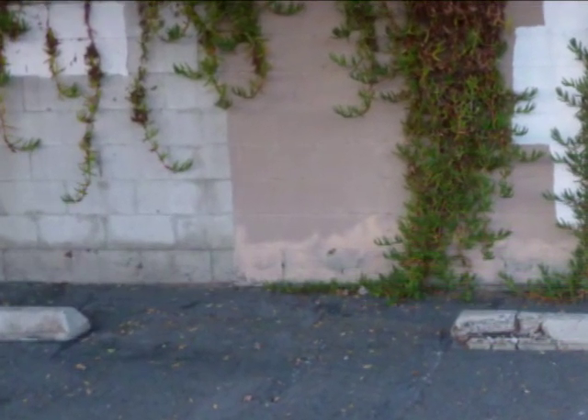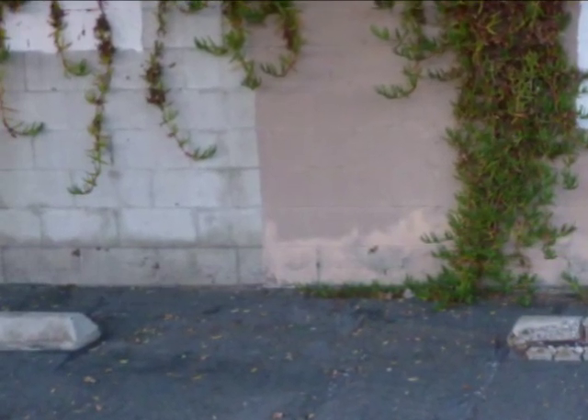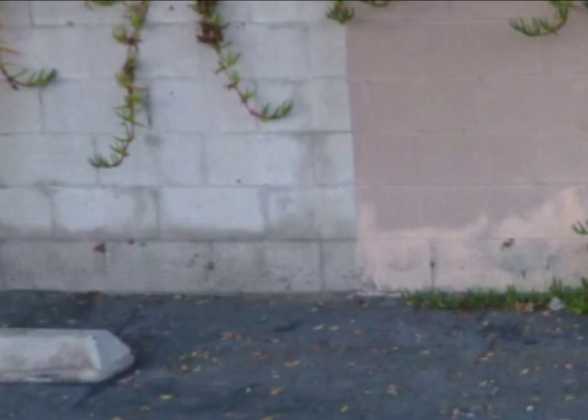As you can see here, I'll point it out — you can actually see the moisture at the bottom of the retaining wall. In the next couple of pictures I'll show you what it looks like. It's basically the discolored area at the bottom where moisture is coming through the retaining wall in the area where it is not painted. The paint sometimes will keep some of this moisture back — I believe I made another video on how it really isn't good to paint a retaining wall.